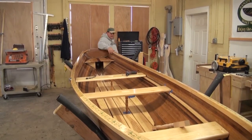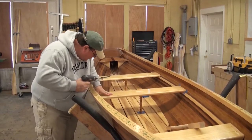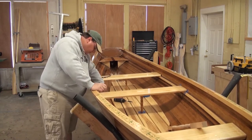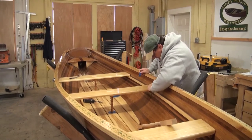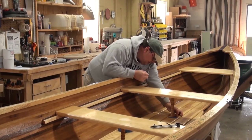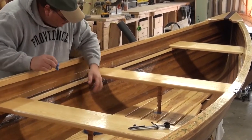All right, let's take some screws and set that seat down. Screws are set — I feel a little bit of ooze underneath and it's coming out the sides, which is a good thing. Everything looks right here. Go ahead and pull that tape up. As always, we're going to go back and clean up. You can probably see that ooze as we gently pull up this tape — which is perfect, that's exactly what we wanted: oozing right around that spindle to give flexibility and keep water out from underneath.